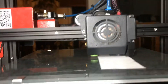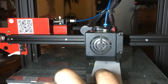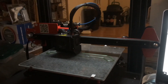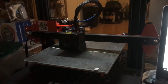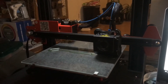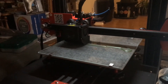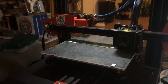It brought it in — that paper test — oh yeah! Perfect, and I didn't even have to mess with it. Couldn't ask for more. I've done quite a few successful prints since changing out that sensor. I really haven't had to mess with it since just getting it straight and level the first time after it went in. Not sure what was up with the original one — the printer wasn't even a few months old. Hopefully that helped somebody else. The first time that head rammed itself into the bed it sure freaked me out, but no big deal — easy to fix, workaround included.